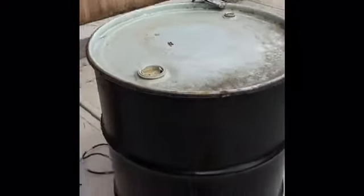Not the best welds I ever made, but just quick and dirty. I tacked some little tack welds all the way around. You never want to weld something fully closed without leaving a vent hole because it could explode — that's not good. Now I'm going to start with my angle grinder with the cutoff wheel and do these seams, then pick up with a jigsaw and go down my line.